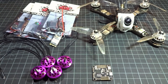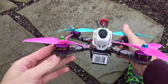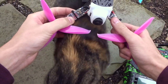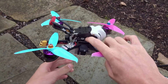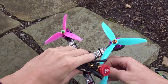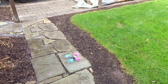So that was a real quick overview on the parts going into this. Let me swap them in, build it up, and then we'll take it out and see how it flies. Here we are for the quick line-of-sight test with the updated Beast X, running the DYS Mars 2306 2400KV motors, the DYS Aria 32-bit ESCs, and the X Racer F4 running 8K/8K Betaflight 3.2.1 and DShot 1200 on the ESCs. Very nice low idle.